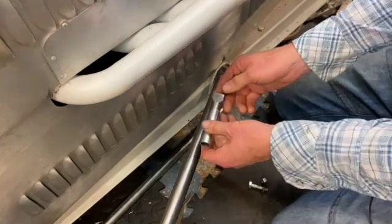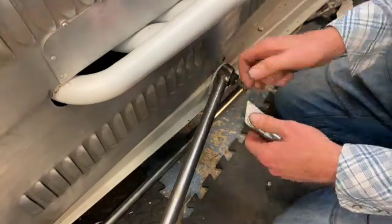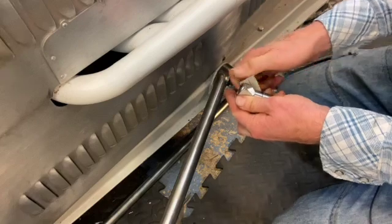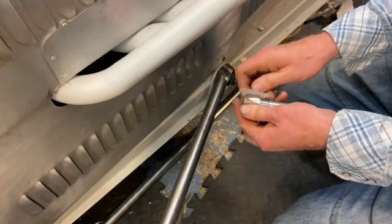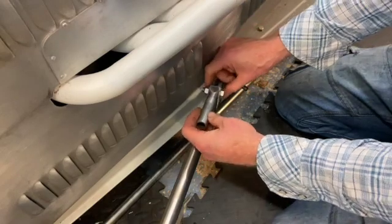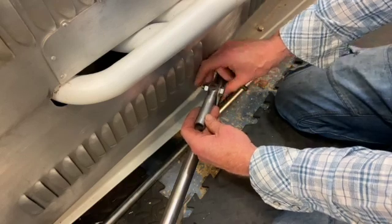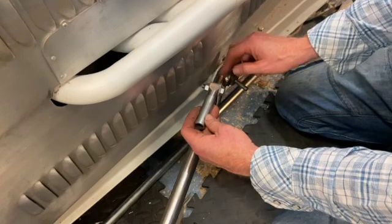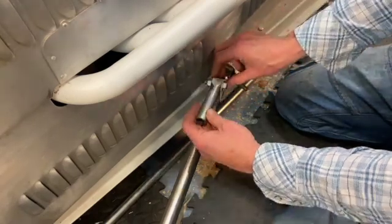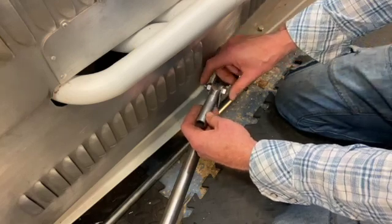That goes into the end of there. I'm going to have a long link, and what I've done is made these two cardboard templates. The way it's going to work is — if I just put these on here like this — it's going to work like that basically. I'm going to weld these two brackets onto there like that. I'm going to make these out of some chunky plate and chamfer the bottoms at about 45 degrees so it sits nicely onto this tube. I'll run a weld on the outside and try to get as much weld on the inside as well — it should be nice and beefy and strong. So, make some brackets.